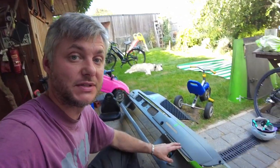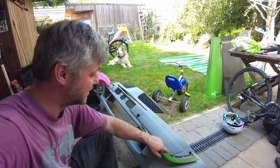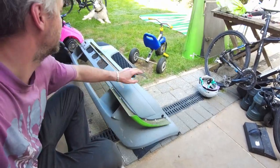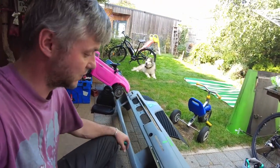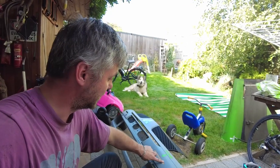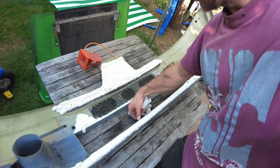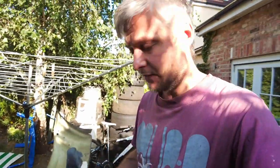So the first step is to take the canards off, then all the quick releases and those plates I've put on there. Then we need to clean it, wash it, polish it, then fill all the grooves that we don't need, and fill the cutouts with silver tape. We need to make sure all the flexible parts, for example here, you can see how it flexes, don't flex, because when we apply fiberglass as a mold, it shrinks and warps stuff. So if it's really flexible, we want to prevent that.